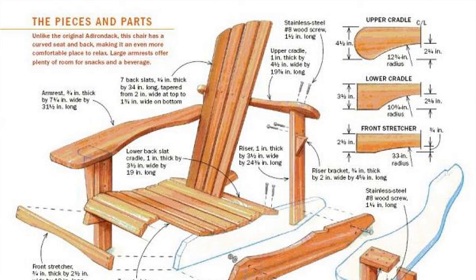5. Position an arm on top of the front leg and nail through the back leg to hold it in place. Tack the front of the arm onto the front leg and attach the bracket support with screws in the middle of the front leg under the arm. Adjust the arm's position and attach with deck screws to the bracket, front and back legs. Remove all temporary holding nails as you permanently attach the arms. Add buttons to countersunk screws or dowels, sand and seal or paint.